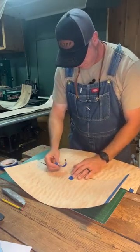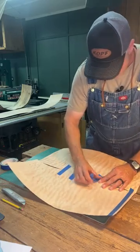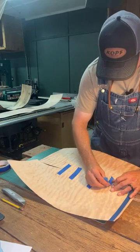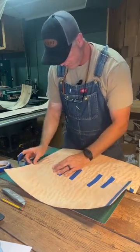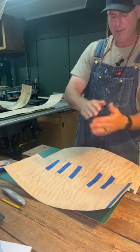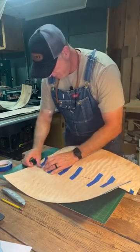You have to be real careful with these, because before they get glued up into a faceplate, they're really fragile. But I use a type of glue called urea resin glue. It's actually the kind of glue that they use when they make skateboard decks. It dries really, really hard, and it's really, really durable. If you use other types of glues with veneering, sometimes later on they'll have what is called creep, where it's glued to the substrate, it'll slide just a little bit, and then your book match can get messed up, and it also causes cracks. But with the urea resin glue, you don't have nearly as much problem with that.